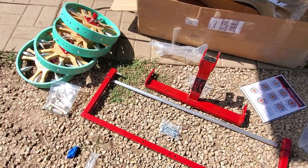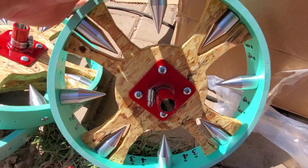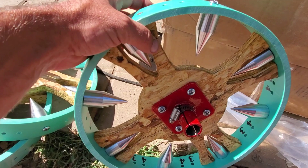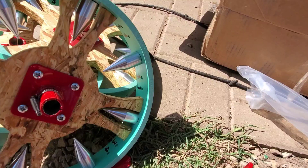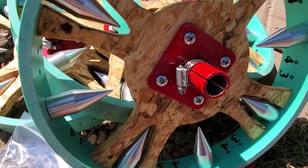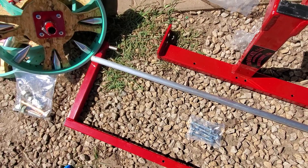The construction of this thing is actually stupid simple. If I had the time I'd build something, but I honestly do not have the time with strawberries coming and onions getting planted out here in the next month. The wheels are a piece of 12-inch sewer pipe, and a piece of super waterproof subfloor that's been milled to fit. There's a metal electrical conduit bracket, and the axle is actually a piece of three-quarter inch conduit with some bushings in the ends to make it roll a little better.